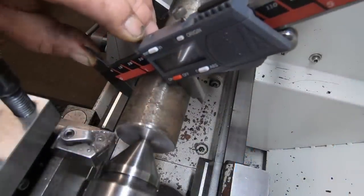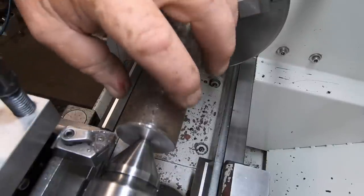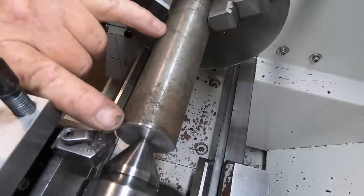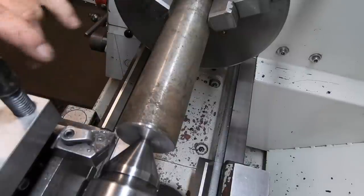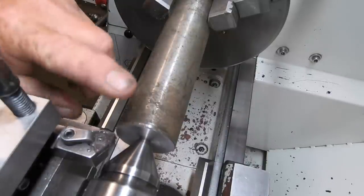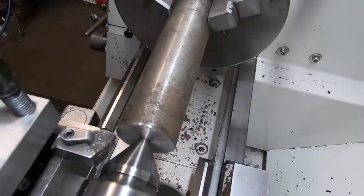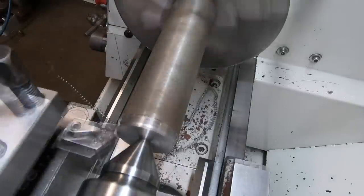We've got 209 thou to come off that diameter. This is going to be the bush that goes through that, where I've just bored them holes. Just have an inch bored hole in the center for the pivot pin. So bring this down to 1288 thou, which when I bored them holes, I just went to any figure, so I'm just going to make this to suit.